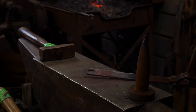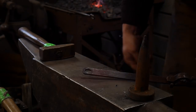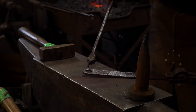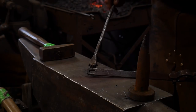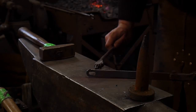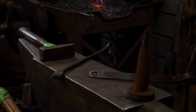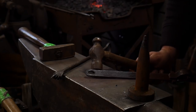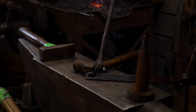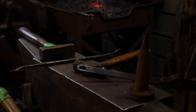That's how you make the oval hole in the end of a ladle handle. Now if you wanted to make this a teardrop instead, I would suggest drifting it out really large — a lot larger than what you need — and then focus all your hammer blows right at the edge of the hole. It might be helpful to switch to a hammer that has a radiused face so you can pinch the material in there a little more as you go. Basically it's the same thing if you want a teardrop handle instead of an oval.